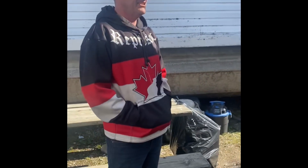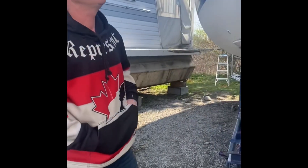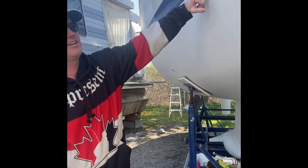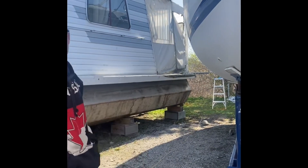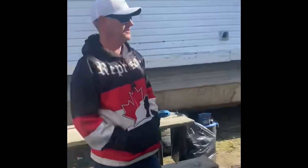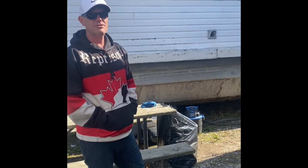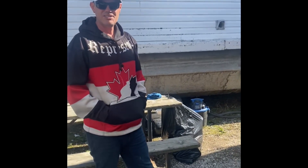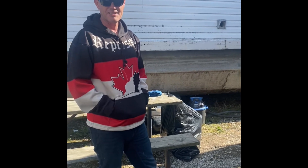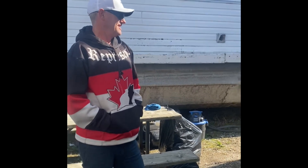Now we're waiting about four days and we'll come back on Thursday - it's Sunday today. Then we'll do the next coat of epoxy from the waterline down. Once we've got that on, we'll wait a few hours and start with the first coat of antifoul. Let that all set up and then do one more coat of antifoul, and then it's ready to go in the water. As soon as they get the motor put back together, we can get the solar arch on.